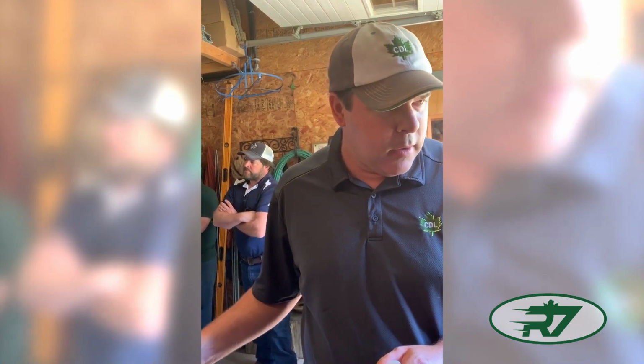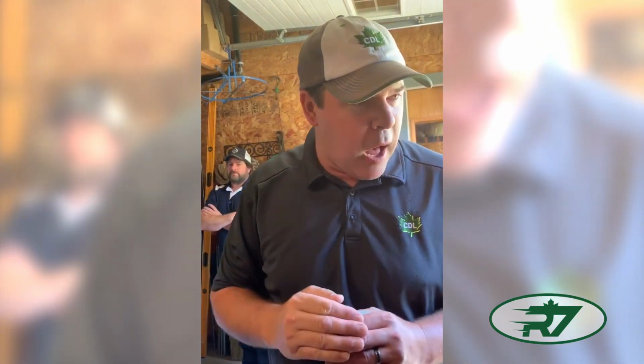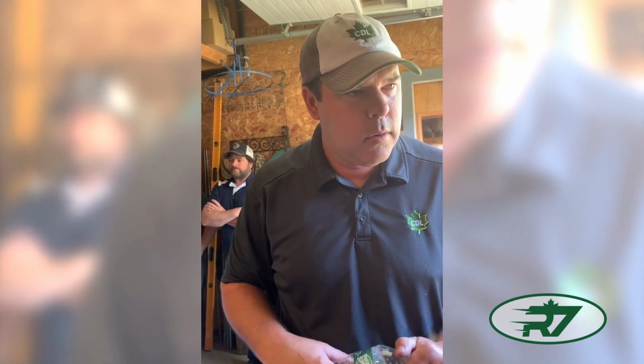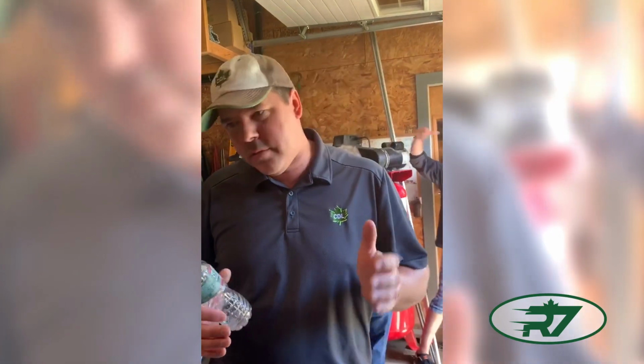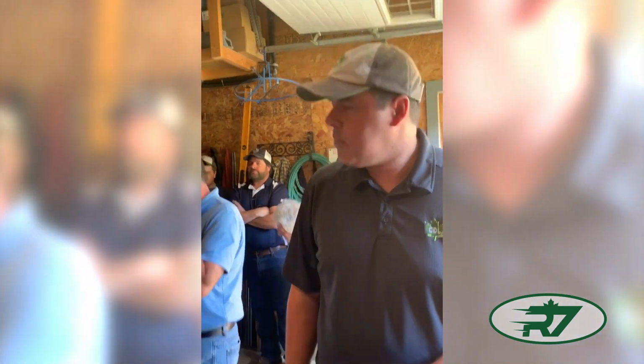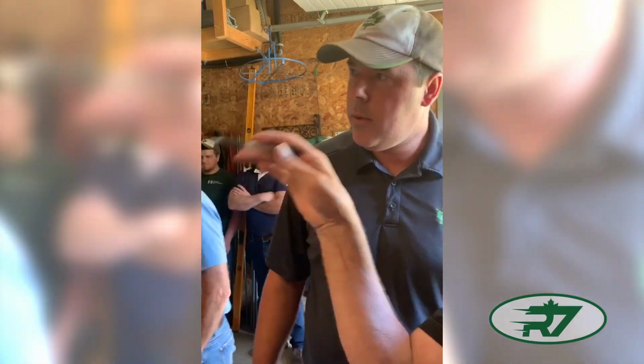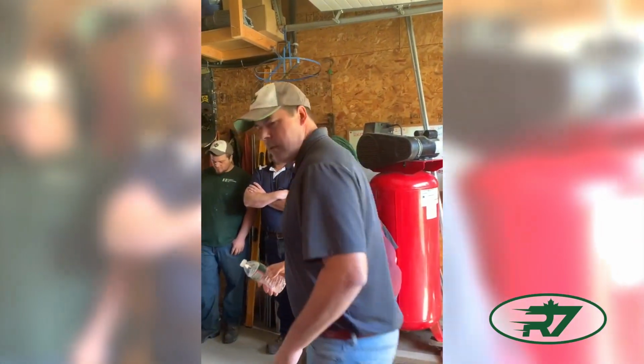With the VPR valve at 65, they figure we're making 2,600 pounds of steam per hour. So your 100 horse will be a little, you're looking for 100 horse? Yeah. So, is the main water automatic or is that manual?